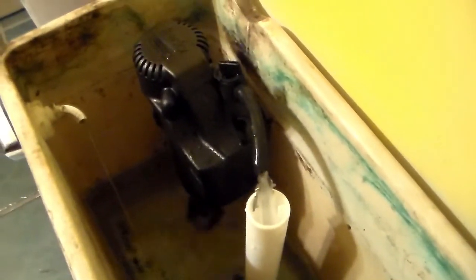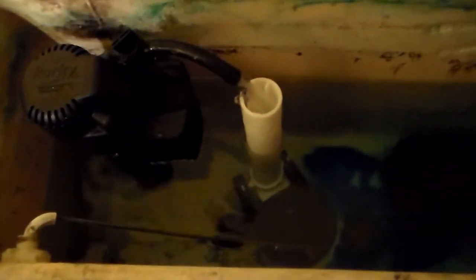That's all there is to diagnosing and repairing your own toilet. If you hear water leaking after flushing, it could be your plunger, or the chain tension not adjusted right. The most common things are: the handle rusts out, the chain rusts out, or the stopper gets warped or builds up gunk so it's not sealing properly, allowing water to sneak past. All very easy, cheap fixes that save you from calling a plumber. Really hope this video helped — if it did, please hit it with a like and subscribe. I'm going to be posting more around-the-home videos to save you money on your own repairs.